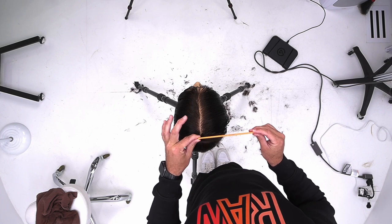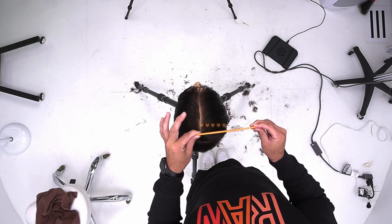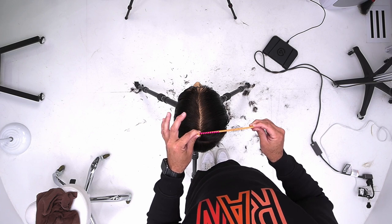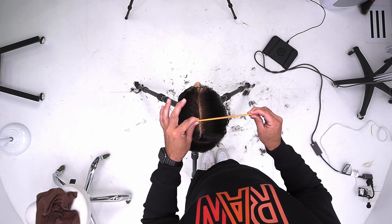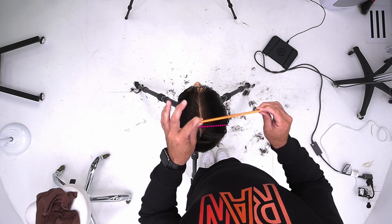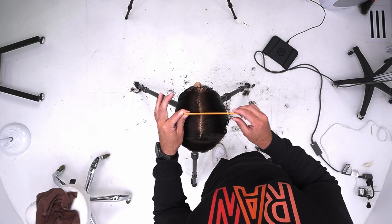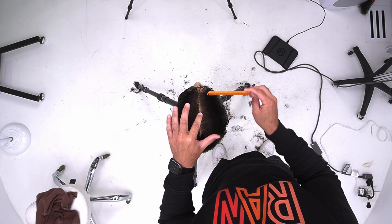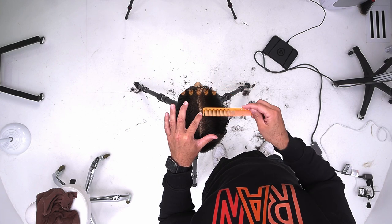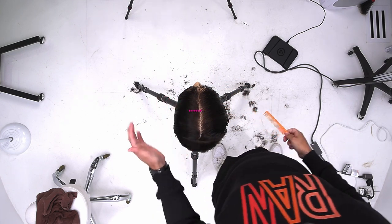Section one I'll cut to create a guide. Then I'll go to section two — I'll push section one halfway to section two, section two halfway back to section one, and cut to create the next guideline on section two. Then grab section three, pull that back halfway to section two, cut it at two, creating a new guideline for four. We just continue all the way up. When we get to the high point, it becomes stationary, and everything from the front I'll pull all the way back to four and cut it right at that point — giving me a little extra length into the front.